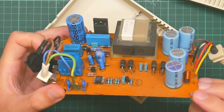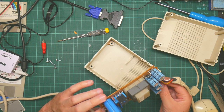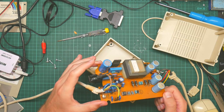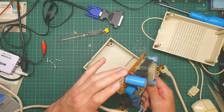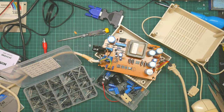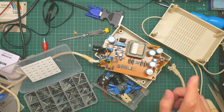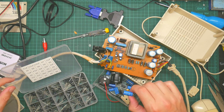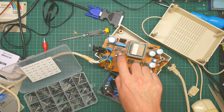It's all enormous great through-hole stuff, so it might be worth just replacing them. This one is a 47 microfarad 385 volt. 4700, 16 volt — they're all the same. These little ones are 470 microfarad at 16 volts, and 220 microfarad at 25 volts. Let's have a look at my capacitor collection. I don't have any capacitors big enough — my small ones only go up to 47 microfarad, and I need 470s and 4700s.